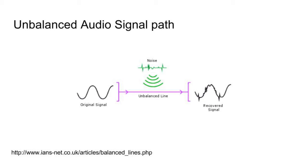What is an unbalanced line? Unbalanced lines consist of two wires: one which provides the signal and the other which provides the reference, which is the ground or shield. These are the types of connections you get on guitars, keyboards, and some domestic audio equipment, and are usually quarter-inch jack connections or RCA connections. They are used to connect unbalanced equipment. The disadvantage is that the line itself is exposed to noise and electrical interference along its length, and that noise appears superimposed on the wanted signal at the receiving end. Cable shielding helps the situation a little bit, but in general unbalanced lines are very prone to picking up electrical noise.